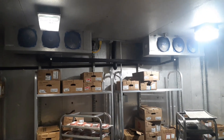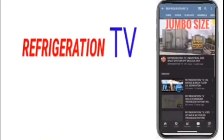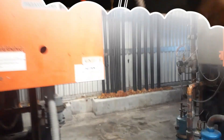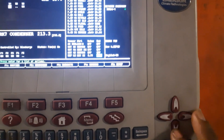We just got a service call - a freezer running warm. I want to walk up and check my compressors to make sure they're running, and so far they all look to be running. We're at about 10% on the liquid now. Sight glass looks clear. Checking IE2 - rack 8 is right here.